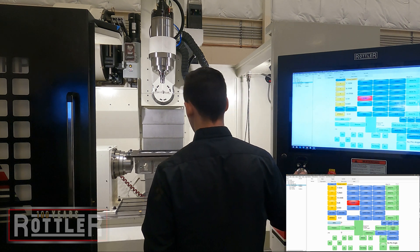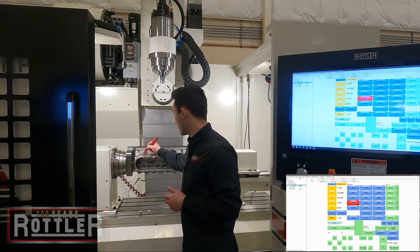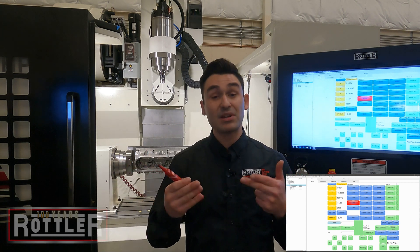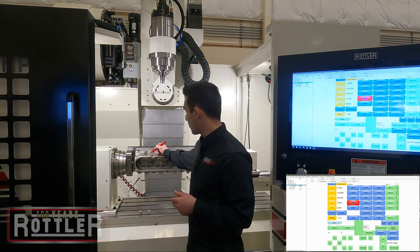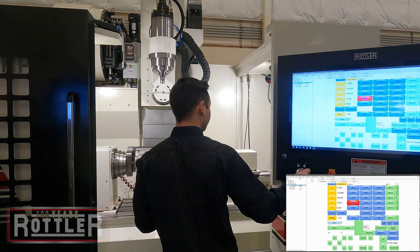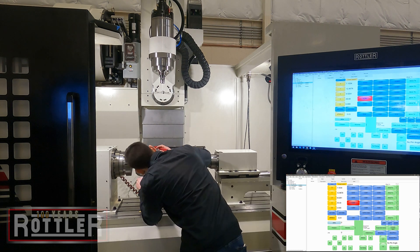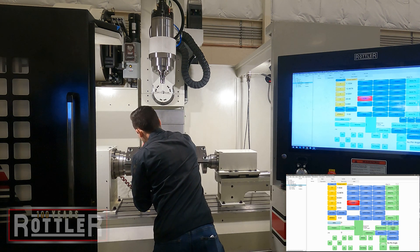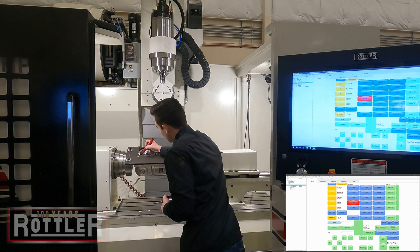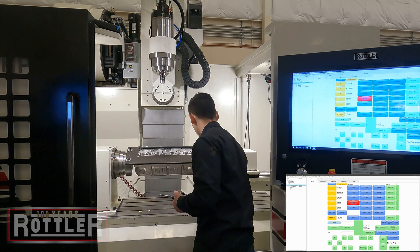I'm going to go ahead and mark this up. On the manifold, I want to make just three points — two on either side of the port and one on the opposite direction. That's going to make the center of the plane the middle of those three points. Always make sure the points you're going to probe are going to get you close to a theoretical center of the port. For my rough setup, I'll take my tool, stick it in, look at about as far as I can get in, and make three marks with my Sharpie. Same thing for just below the seat — I'll make three red dots.